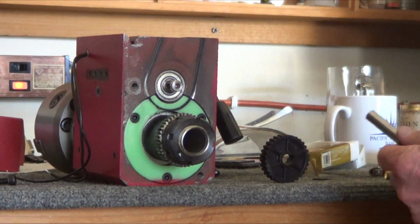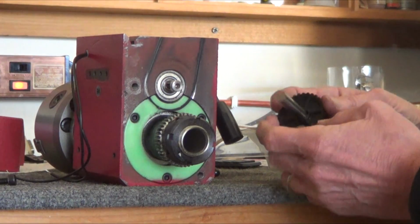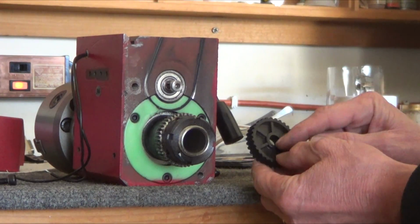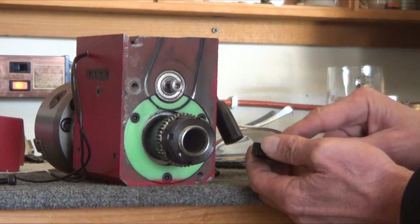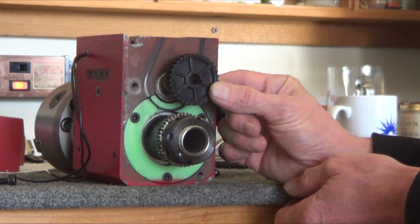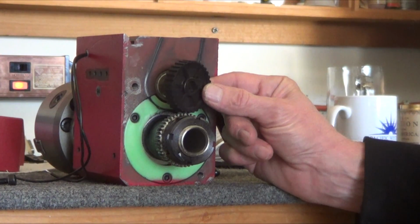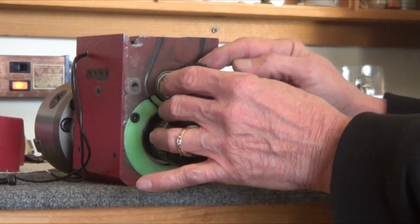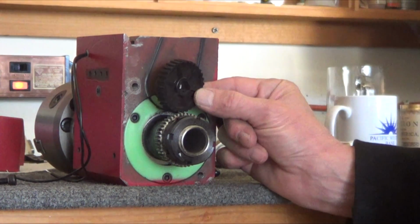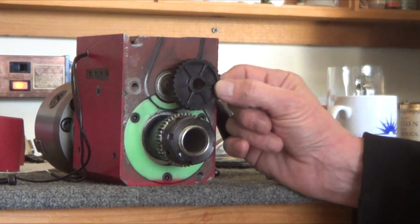But yeah, I said the gauge pin, and I was looking at this going, okay, the gauge pin fits in tight here, but it's sloppy here. And I was looking at the surface with the magnifying glass. This surface is completely scored, so this was the washer side. So how did I figure it out? It got pulled this way. This was tilted this way because the belt was rubbing here. It was more on this edge, pulling on it, and it wound up funneling this opening wider. So there's more reason why I want to get a better spacer back here to keep this straight.